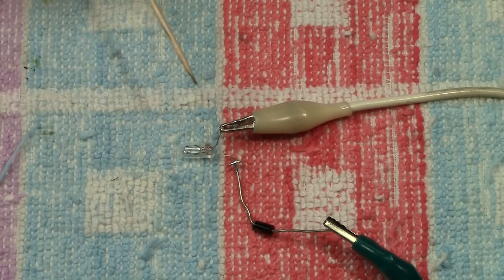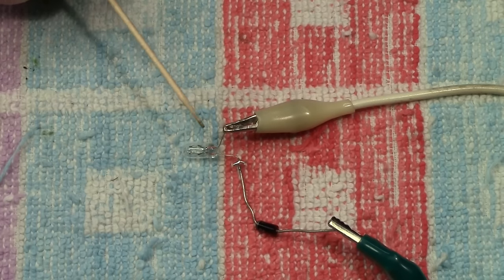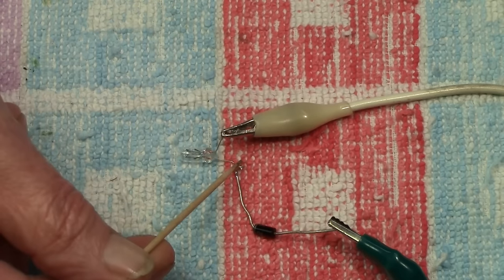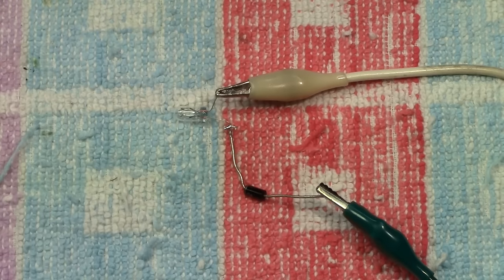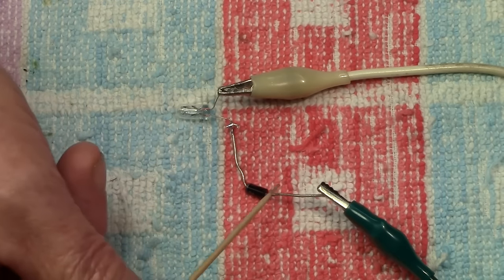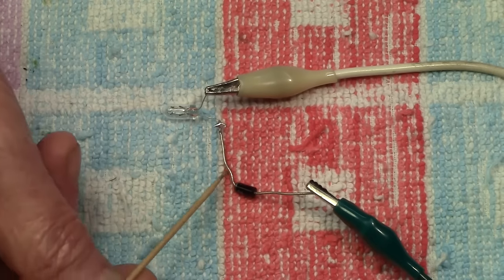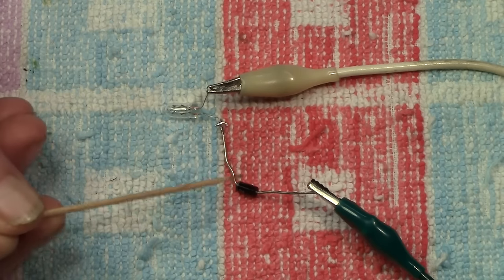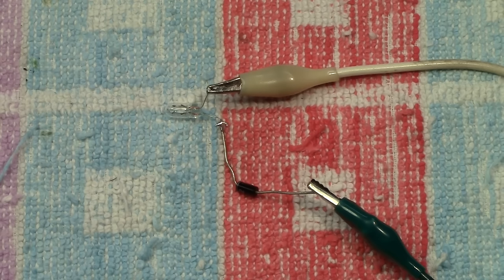Now you remember initially we put the two wires on the bulb and it lit up both ways with the controller. But now we've put a diode in series with one of the legs of the bulb. That means it comes through the diode to this leg, but the other leg is directly connected as it was before. Now, by doing this, the diode will only let the current pass that way, from there through to that end with the mark on it, the positive mark. And I'll show you, I'll turn the controller one way. There we go, we have the light as we did initially, but now that is fully the other way. The diode here is blocking it, which means it's only going the one direction, which means if we do the same thing again but reverse it, you'll see what happens.